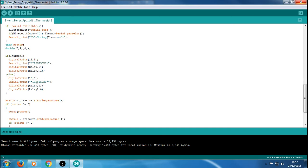It's going to send that message to the phone application, which is just going to set the indicator red, the red part of it. Basically, we're setting that high, and we're setting the green and the blue to 0 because we don't want that colour there. We just want the colour red. So we've set that full to indicate that the relay is turned off, or the thermostat's at its temperature, let's say. So that will turn off, and we're setting relay one high, which is obviously going to turn that relay off. And then it will turn relay 2 on if we had a heater attached. In that situation, it doesn't have to be those two things. It could be something totally different.